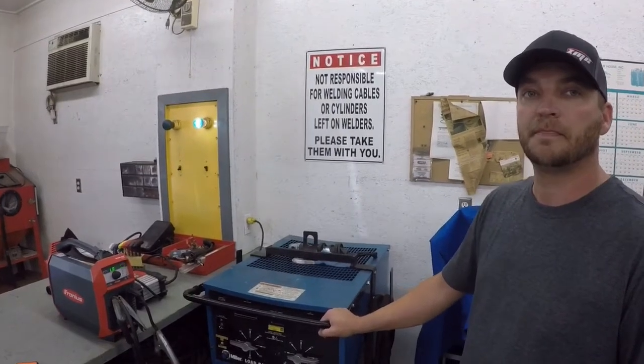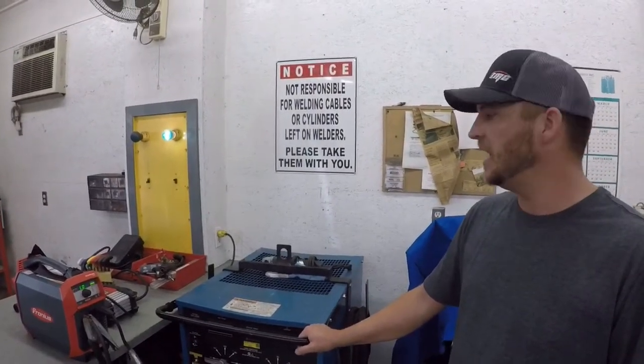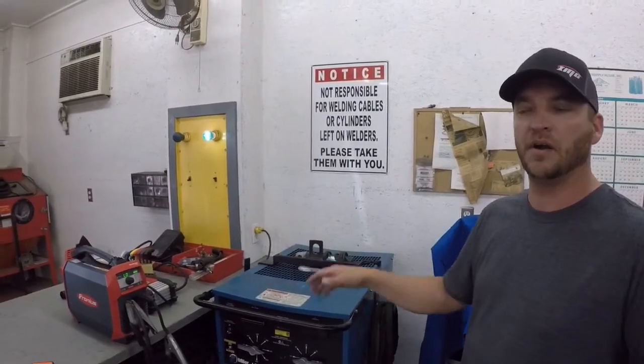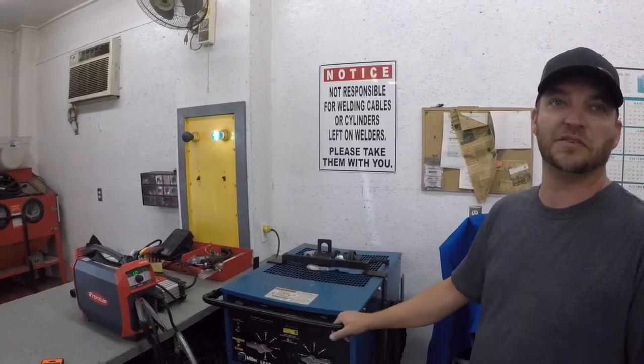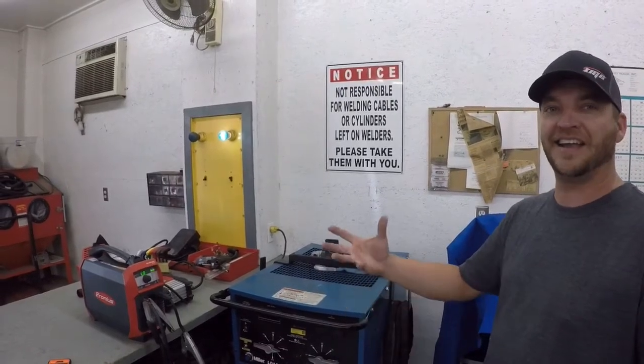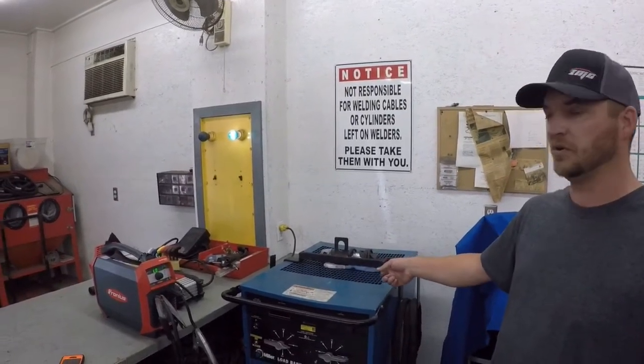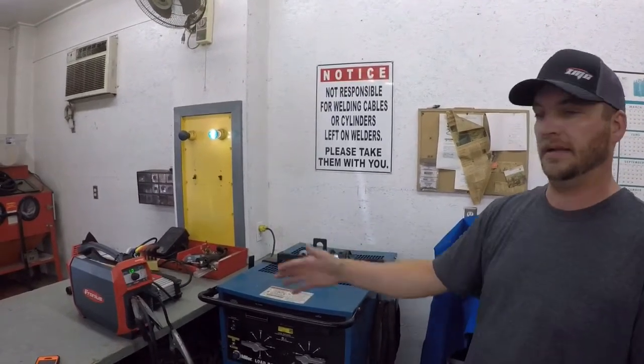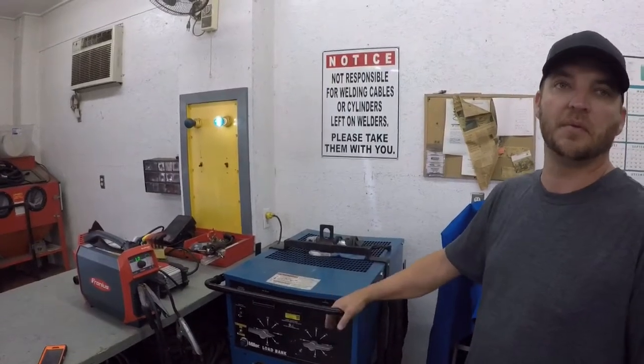You said the reference is sort of like an oven, is what you said? Yeah, I mean, the coil in your oven, the burner in your oven, those are just big resistors. That's all they are, and they turn red, get hot whenever you put voltage to them. These right here will do the same thing with a high amount of amperage. 120 amps isn't much on this, but it serves the same purpose. Does the same thing.